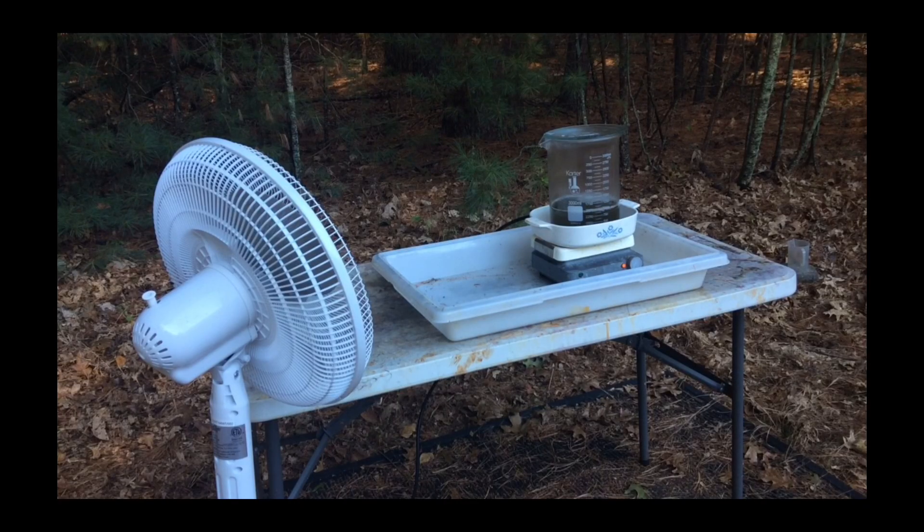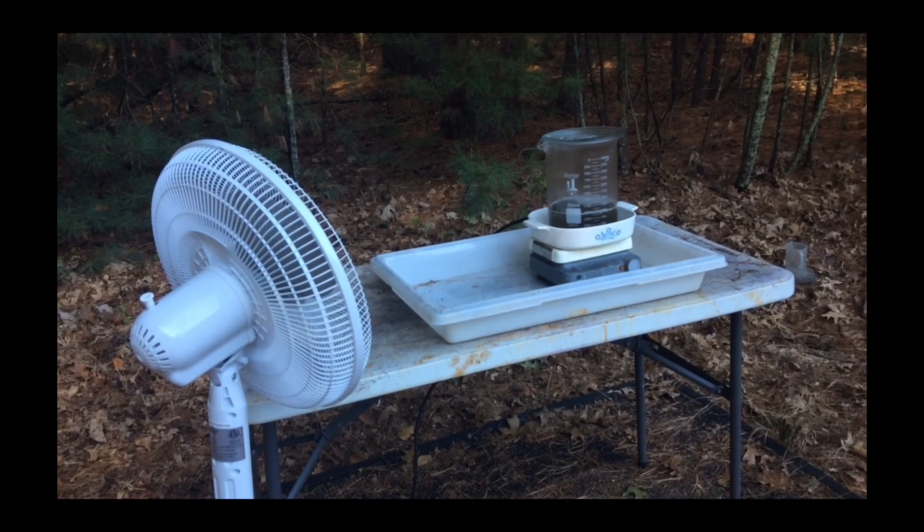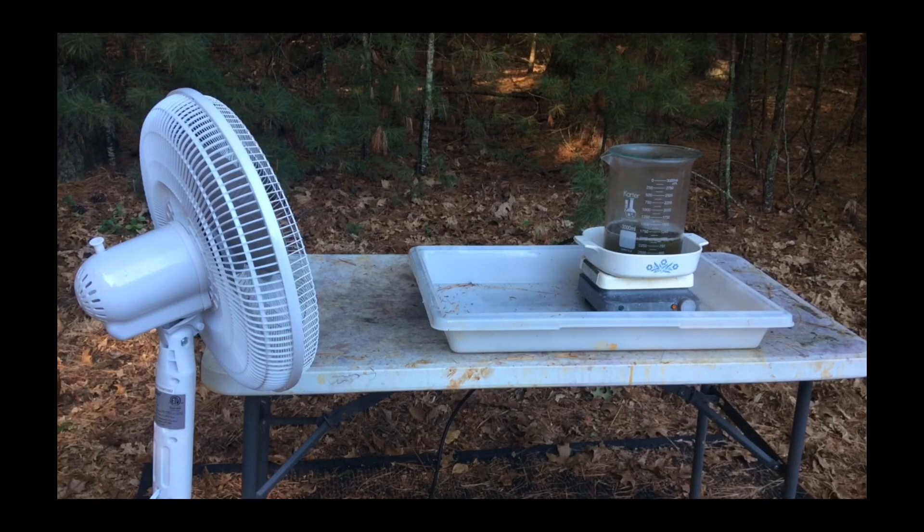My backyard lab bench, shown in front of us, is simple and efficient. It does not need to be complex to be effective. I have my gold foils in a 3-liter beaker. The foils are covered with approximately 1 liter of hydrochloric acid. That beaker is sitting in a cooktop safe casserole dish on my hot plate. Naturally, I have a watch glass on top of the beaker to prevent any loss of gold. And that whole setup is sitting in a large pan to catch any overflow, should there be one.